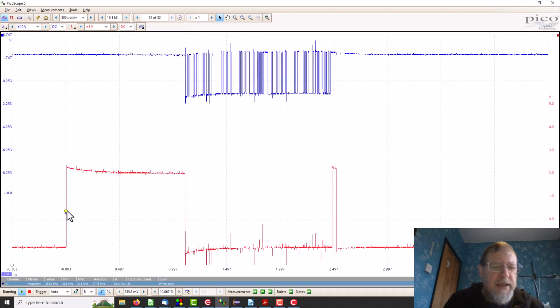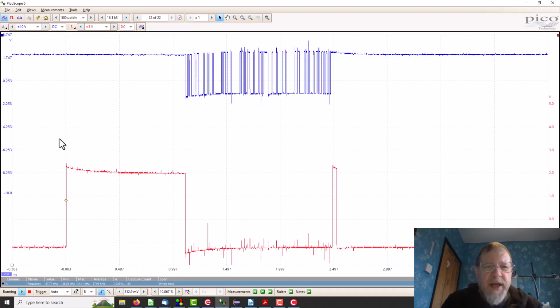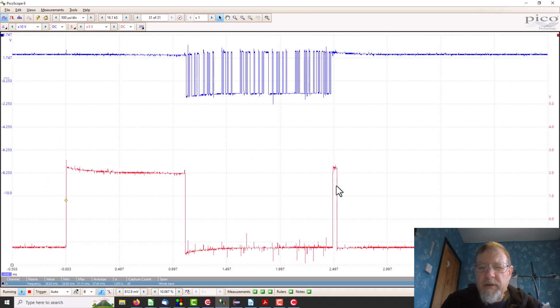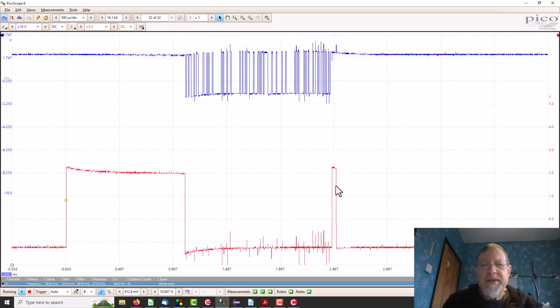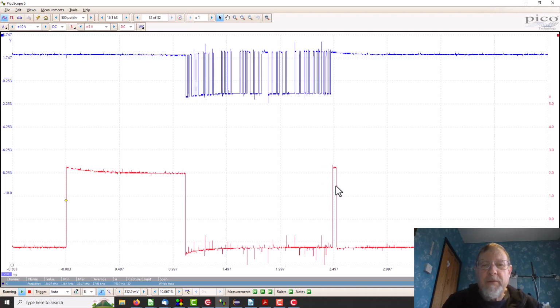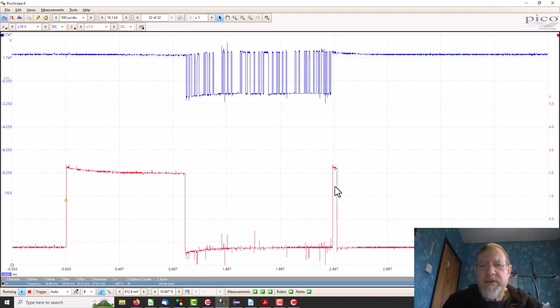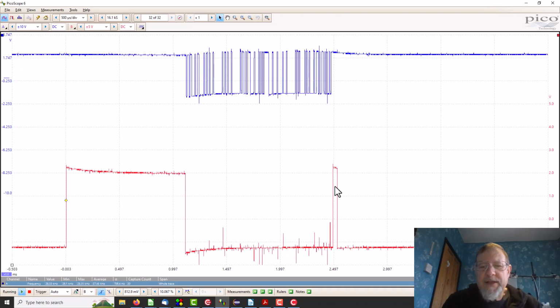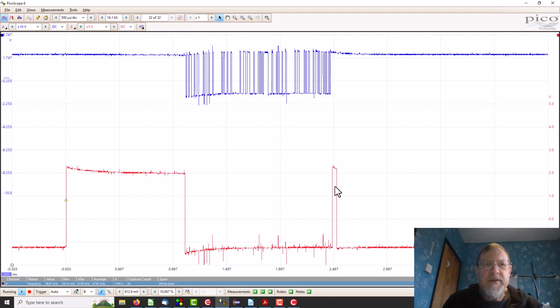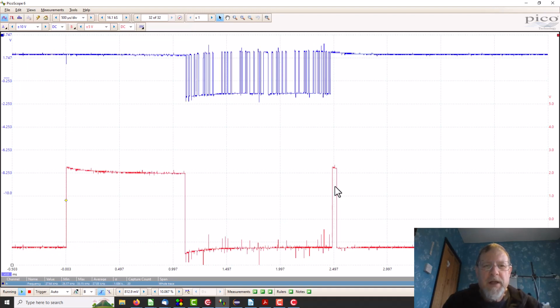Excuse the slightly erratic triggering. And you can see, so that's 0. So if we look at that point, it's 2.6 milliseconds, and we were looking at 1 millisecond, but that might do. So we are going to now set the thing to 3 millisecond update and see how that goes. And if it's not fast enough, we can probably read the I2C quicker.